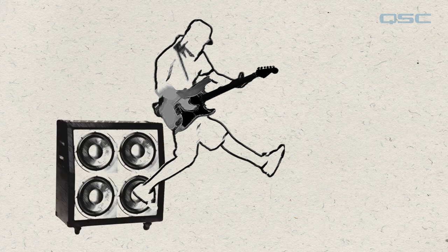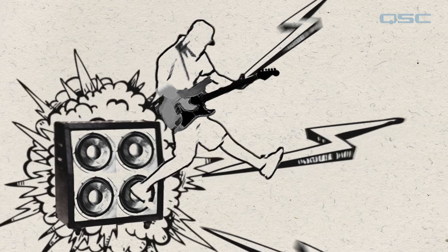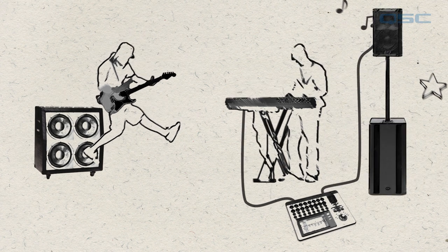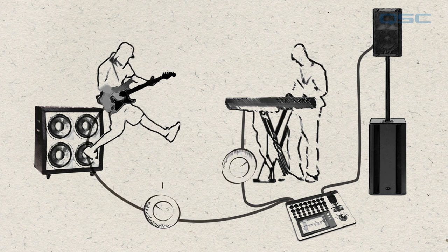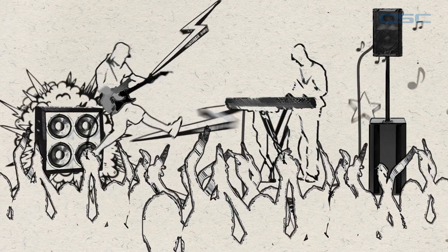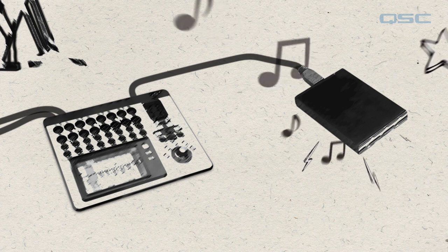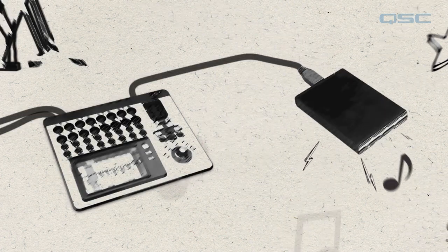So why would you want to use the aux outputs instead of the main outputs? After all, it sounded good in the house so the recording should sound good, right? Not necessarily. Say you've got a guitar player with a screaming 412 cabinet and a killer amp head — his stage volume is so high that you don't really need to put any guitar in the PA. On the other hand, the keyboard is plugged directly into the TouchMix, so without the PA the keyboard can't be heard at all. For the live sound mix you'd have little if any guitar in the PA but the keyboard would be really loud. The live audience would hear a good balance, but a recording of the main output will have a lot of keyboard and not much guitar. The instruments that are loudest on stage will be vastly underrepresented in the stereo mix. A recording from the main stereo output is only going to sound like what you're sending to the PA — it's not going to capture what your group sounds like in the room.